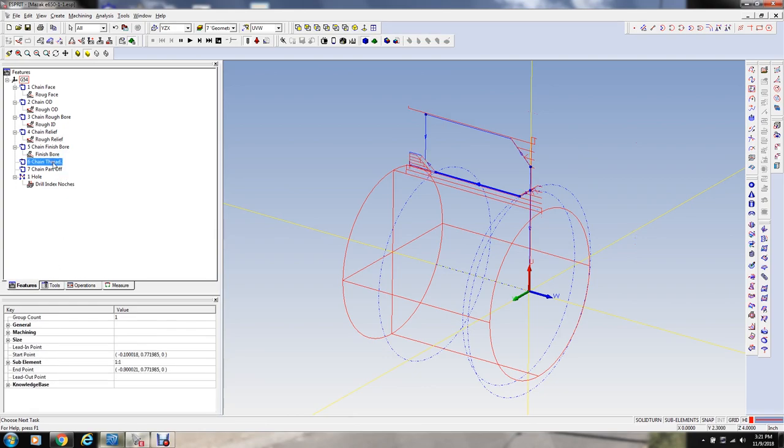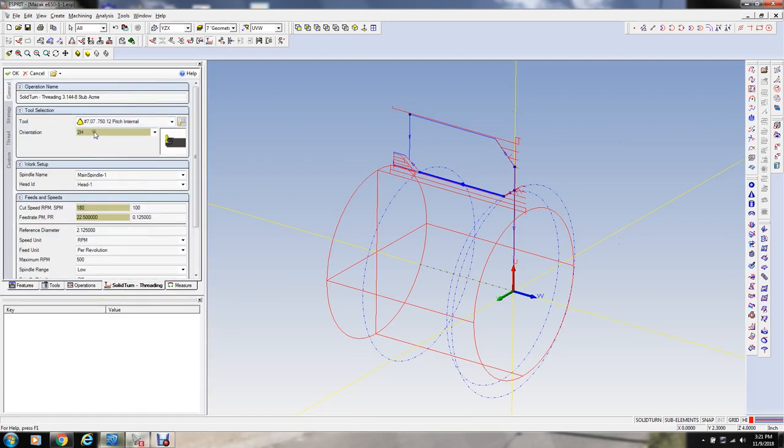I'm going to have to look at some data here a little bit. According to the gauge maker data, this is an inch and 5/8 12 thread. So we're going to select our threading cycle. That's our threading tool. Picture doesn't mean anything. It looks a little different. We want to have it positioned like that. Let's see, what are we going to do here?